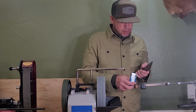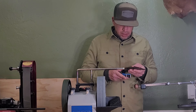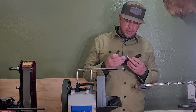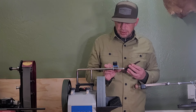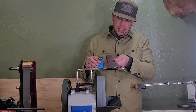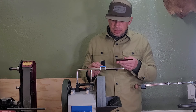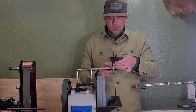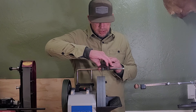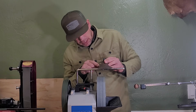So now we're going to want to take this. The way this jig works for the Tormek T8 is it's got a couple holes in here. This axe jig will slide on here, and then you'll set it in there, and that'll hold your angle true every time in the wheel. So what we're going to do is we mark this edge with some Sharpie, set it in here, center it on the jig, and make sure this piece here is laying flat.